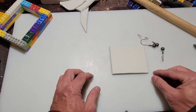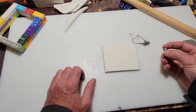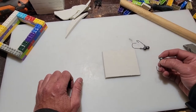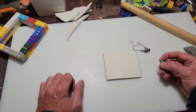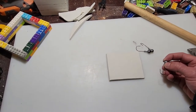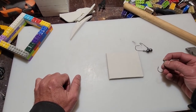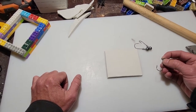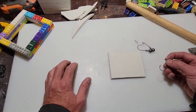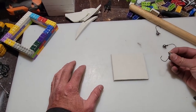Jig heads! I'm going to be able to make a plaster mold of jig heads. And the reason we can do this is because of the plaster of Paris, whether it's the normal DAP plaster of Paris or the harder plaster that I'll again put in the description, which is about 5 times harder than regular resin. Well, I'm sorry, regular plaster. The temperature of melted lead is 622 degrees, and the temperature that plaster can withstand is quite a bit more than that. So this will work, and you can make your own jig heads with plaster and lead.